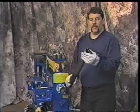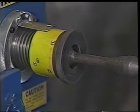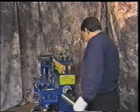Next, we're going to take that segment back off. We're going to size a piece of 2 1/4 to go over itself. We'll actually pick up the fingers that you can see are orange and green. This segment will do 2 1/4 and 2.5, noted by the colors that are on the side of the bender. Physically put those on the machine.